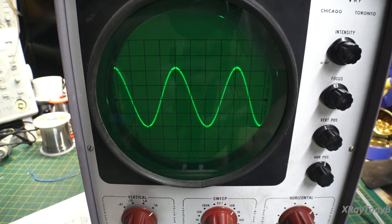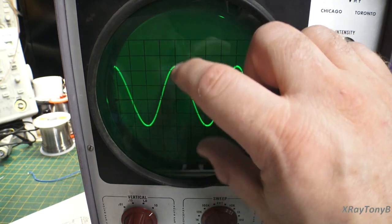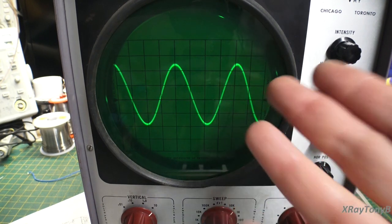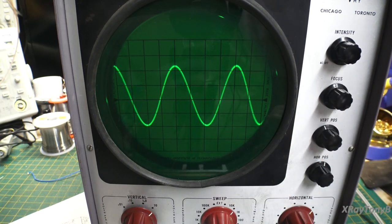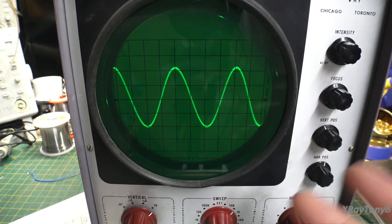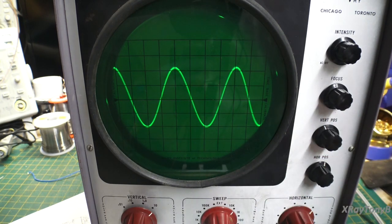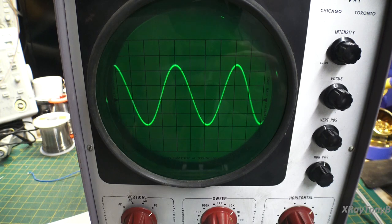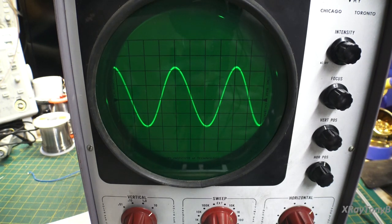of the signal generator, but if you notice, the amplitude changed on the scope, even though we calibrated it. We calibrated it at 1 kilohertz, but when I set this to 5 kilohertz, it's off. If I set it at a different frequency, it would be on at that frequency and off at others. So this is not a really accurate oscilloscope. All right. So all we can do is basically look at a waveform.